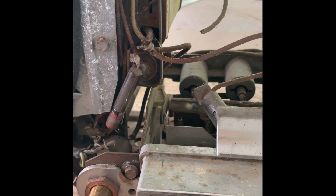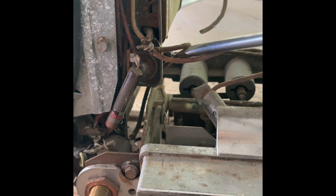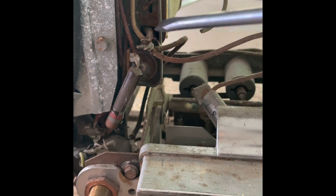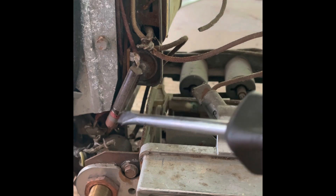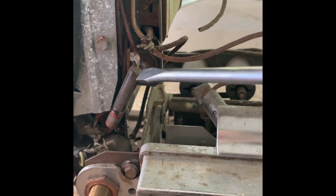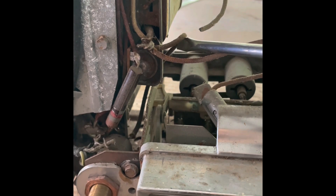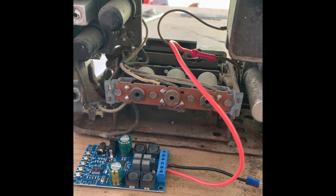This is how I wired mine up. I cut the power from this and spliced into the power to the board, so whenever you turn the power switch on in the car it'll turn on the board. On the back of the wire, it runs up from the back of the switch. It might be a little different on your radio — on my car the wire ran from the back of the switch up front and not back. Anyway, what you want to do is cut this wire, which is the power wire to the rest of the radio, then splice in a new wire and run that to the power side of the board.